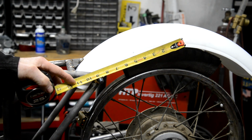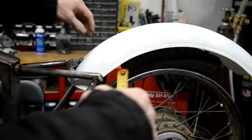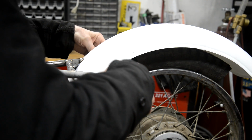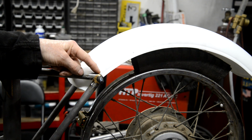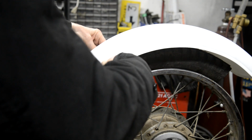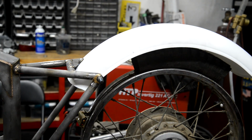Anyway, so we're going to make a loop here. And as I said, the dies for the 3/4 inch are 7 inches on center. And now I've got my proper tape. This is 8 1/2 inches wide. So 7 inches on center would mean that I'm barely out, because center to center, from there to there is 7 3/4. So I'm 3/4 of an inch out.